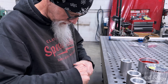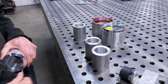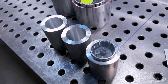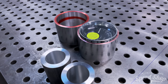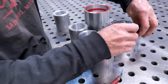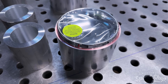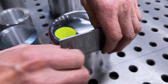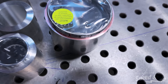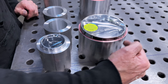These are the gauges — just finished doing the inside and truing the ends up. Got to turn the outside down; we want about an eighth of an inch on the edge, then we'll flute these trying to make them flush with the gauges. It'll be an eighth of an inch out, just like that. Then we'll chamfer this back and flute it all the way around.